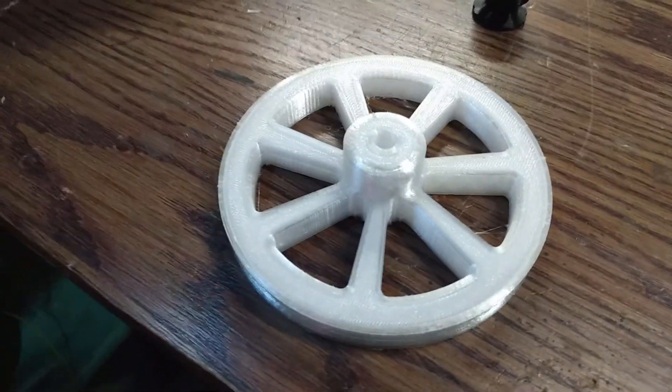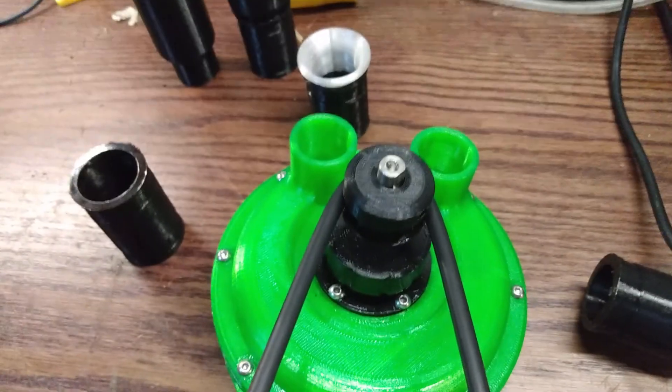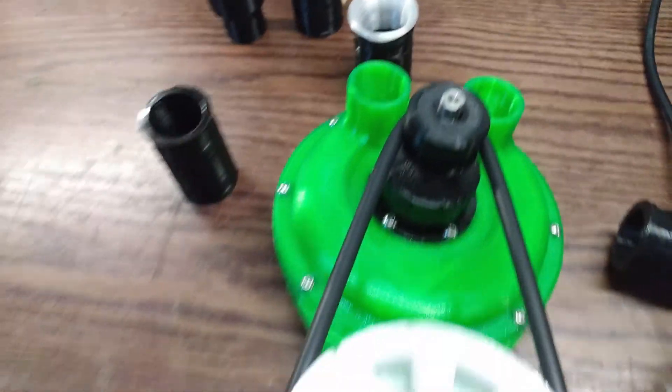For initial testing I used this pulley and this pulley to try and hit about 7,000 RPM, however that little motor just doesn't have the jam to pull that off. So I switched down to a slightly bigger pulley on that one and it seems to work all right.